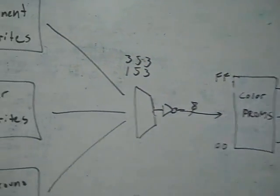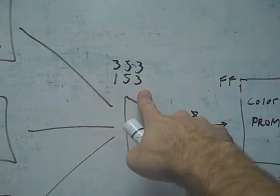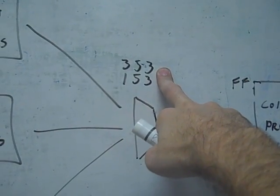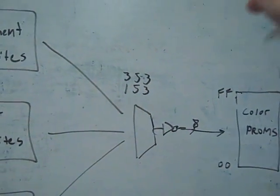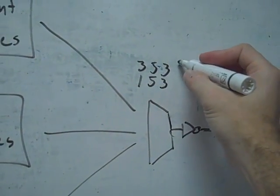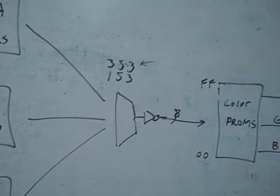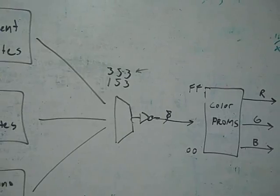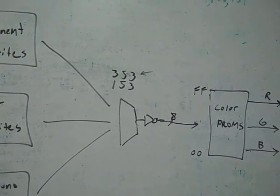What I plan to do is rip out the 153s — I'm not sure why somebody put them in there, maybe they just made a mistake — and throw in some 353s and see if that fixes the problem. These are not very common, but I'll take a peek in my stash and if I have them we'll just swap them out and see if that fixes things.